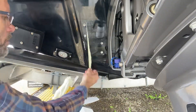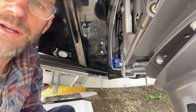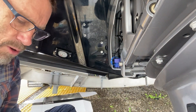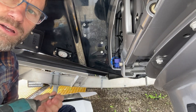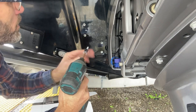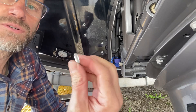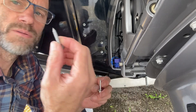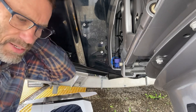Let's take off the masking tape and clean up. I've decided to set a good example and pre-tap the holes with a mild steel screw of the same size, so it's not going to break as easily. A mild steel screw can handle more heat than stainless — if stainless gets hot, that's it. I'll tap those holes so the new stainless screws just glide in.